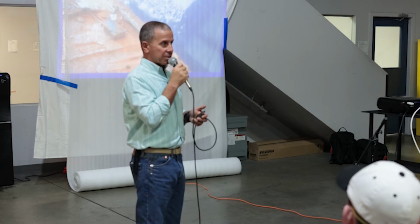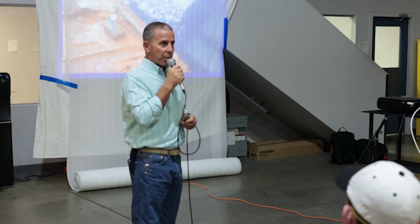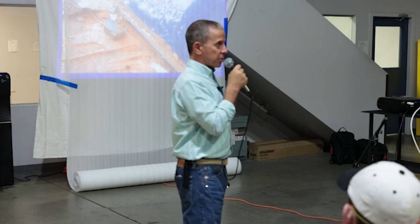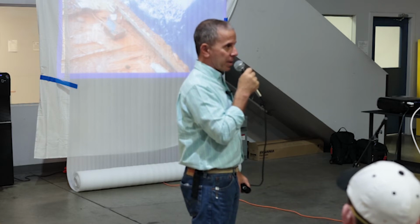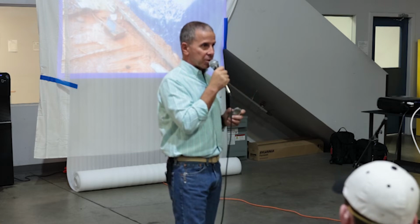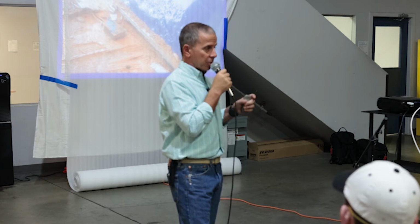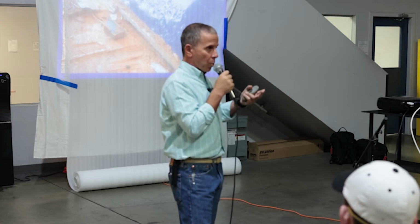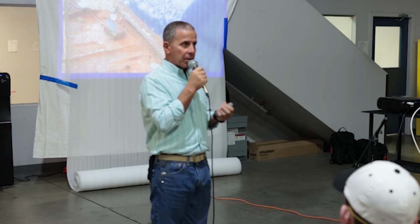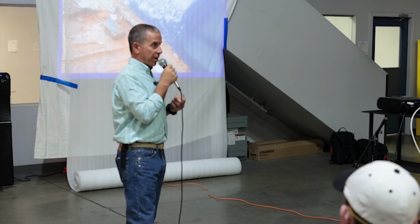Unless it's a paint that is designed to be submerged, like a bottom paint or an epoxy primer, we can actually get water penetrating through the paint. So we have to be cautious about trapping water against painted aluminum structures. And this can happen in things as small as just a nylon bushing that is placed against a painted aluminum surface. Water working its way beneath that bushing and held up against that paint for any length of time can cause paint failure.